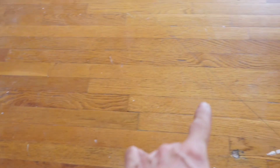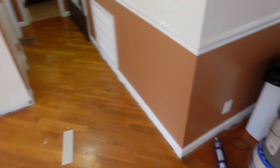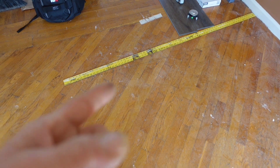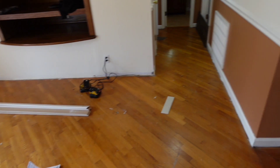I've got both of my lines drawn now. Some of you are probably saying, Z, why do you need two control lines — isn't that confusing? I probably could have used one if the doorway to this bedroom had been lined up somewhere within the hallway. As it stands, I needed two. The second line determines how big my starter pieces are over there. If I want the crack to split the hallway and look symmetrical throughout, I need to line my boards up to find out what my starter piece is over there. I'm going to show you that right now.